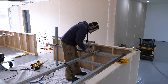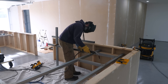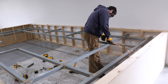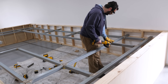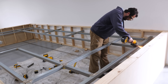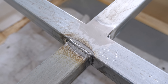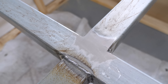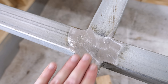This end section was a bit tricky to get level and square solo. No legs are required — I did put a 45-degree brace in the back middle section to make sure the desk would be really strong, since people tend to lean or sit on desks and without legs you want it very solid. Now grinding down the high points on the welds with a flap disc. You can see the weld, then using the flap disc to get it smooth so the desk will fit on there beautifully without rocking.